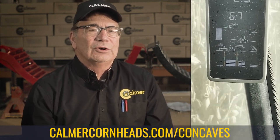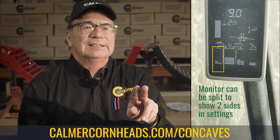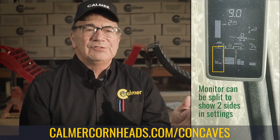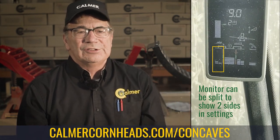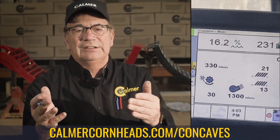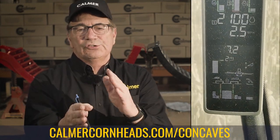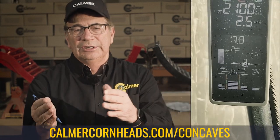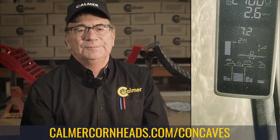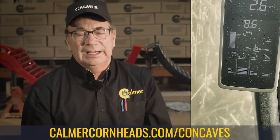In the lower left-hand corner is the sieve loss — you can see we've got minimal loss, and it's split. You can look in your owner's manual or call your dealer, and it'll show you the left sensor versus the right sensor. In the middle, the fat bar is the combination of sieve and rotor. The third column is rotor loss — it looks like a little sawtooth up there and it's also split, showing the left and right side of the rotor. In the far right, the fourth column in the lower right-hand corner is tailings, and in my opinion there shouldn't be much tailings at all when picking corn.